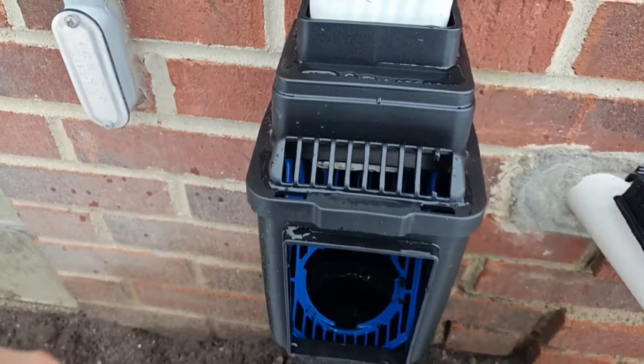My fish tape acted just like it did when I hit the wall in the inline sediment trap. I feel pretty confident that I'm all the way to the other end and I'm hitting the pop-up. Sure enough — there it is, there's my fish tape. Now I'm going to tie a string to the end of that cable. You can see that it's built for that — see how it's like a hook? I'm just going to take some line string, tie it to that cable, and then pull this string all the way through the underground buried downspout system.